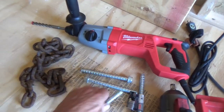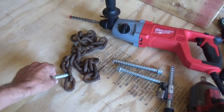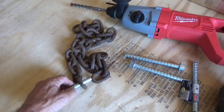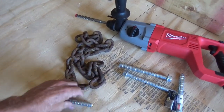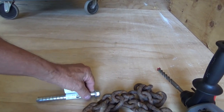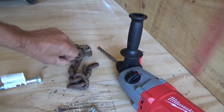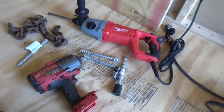Here's what I'm going to drill with. I've got some three-eighths chain here and the end link should thread through. A hammer drill with a half-inch bit — these are half-inch anchor bolts. I'm going to put them in at an angle so I can pull from the left; it might bend or even break the bolt. I've got four of them in case I need more, and I've got several lengths of chain. We'll use a battery-powered impact to run those bolts in.